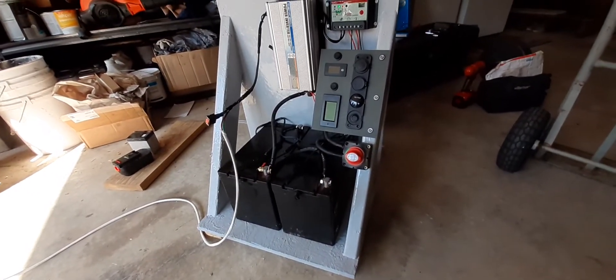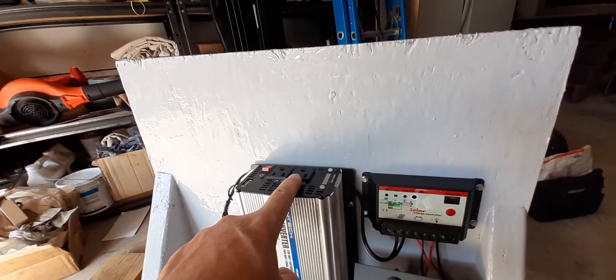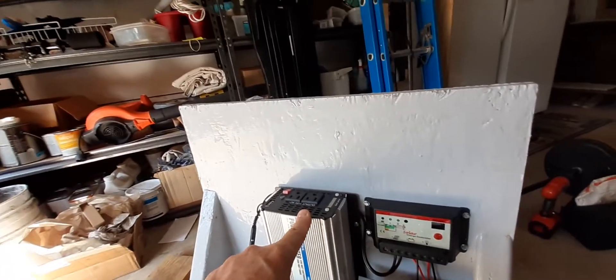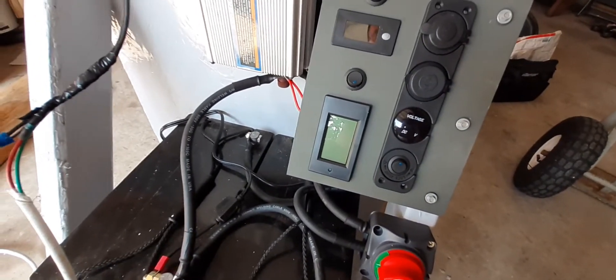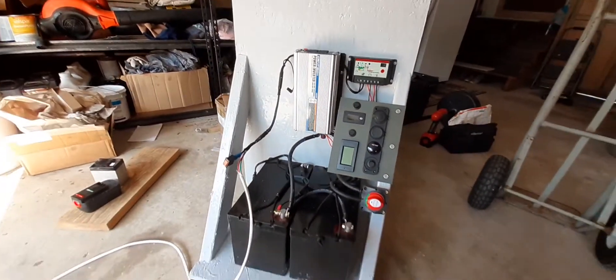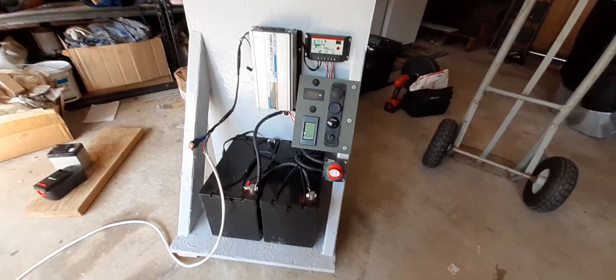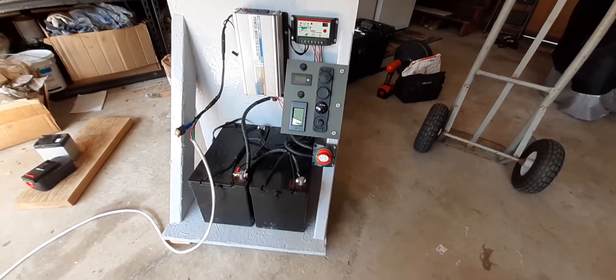Turn that off, and I think that's it for this project. I did not ever wire up this AC indicator yet. I'm probably going to have to run a short cord from here to maybe another plug outlet and then add that load indicator on that stretch of wire in order to get the AC meter working. It's not really necessary since I have the DC meter which tells me what my batteries are doing anyway, so it's probably something I didn't need to get for this — but it was on somebody else's plan, so I was just kind of borrowing off of their design.